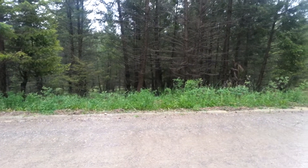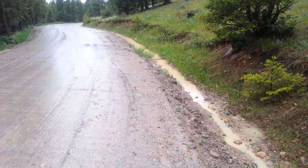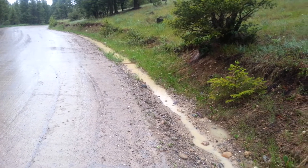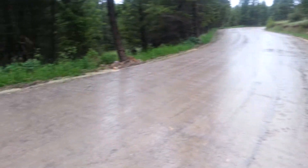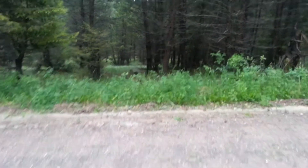In order for a road to be invisible to the rain, you have to have multiple culvert crossings which take the water from the top portion of the road to the bottom portion of the road. And once you take it to the other side, you actually have to do something productive with that water so that it doesn't create erosion.